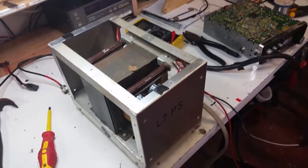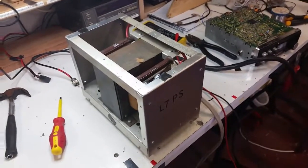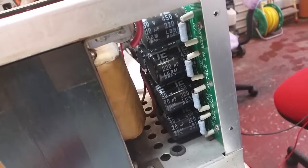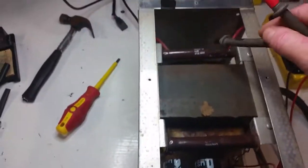— don't go near it if you don't know what you're doing. I left this for two weeks and then shorted it out just to make sure there was no charge remaining in the caps, because there's a big bank of capacitors in there with quite nasty voltages. It will kill you if you don't know what you're doing.